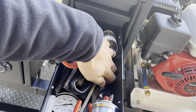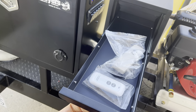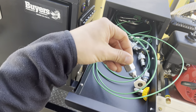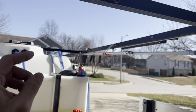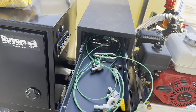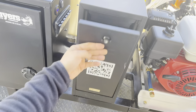I also have a dental kit for getting O-rings out — very handy. One drawer is for extra remotes for the Shirts Box and the AR-45 proportioner system. Up here I have extra tips, and also a safety wire — when you're up on an articulating lift, you must secure your gun. One end goes on the gun, the other connects to the lift so that if you drop it, you don't have to go all the way down to retrieve it, and OSHA requires that anything loose like that be secured.